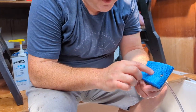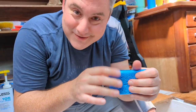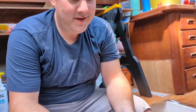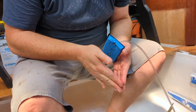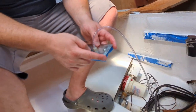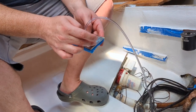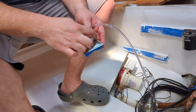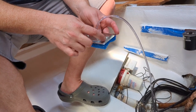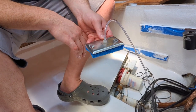We tried putting this in the bilge — look what a sponge does, it sucks up the water, amazing. That worked well, but what didn't work is that the bilge comes to a point at the aft of the boat, so this plate is a little too wide to sit as far back as I want. I'm going to have to nip the tip right here to make it more of a wedge shape so it fits into the bilge better.